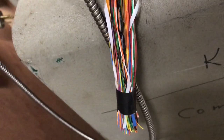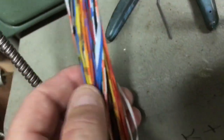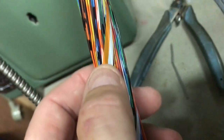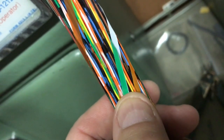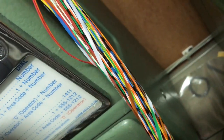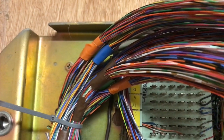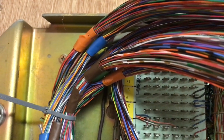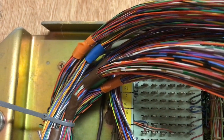There are four groups of 25, so one group of 25 will have some blue tape or plastic around it. There'll be an orange group which is the second 25-pair. The green is the third 25-pair and the brown is the fourth 25-pair. I have taped each of the binder groups — blue, orange, green, and brown — on both of the 100-pair cables so that in the future I can easily identify which 25 pairs goes to a phone.